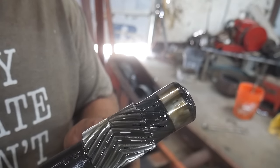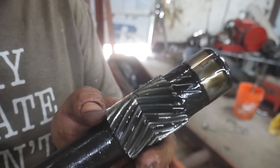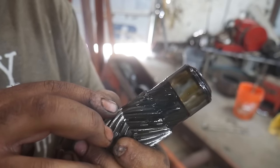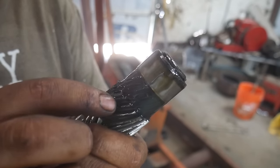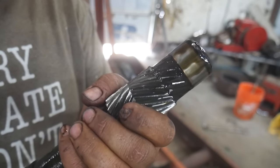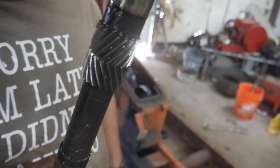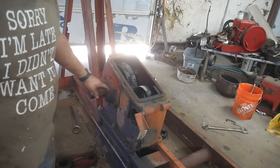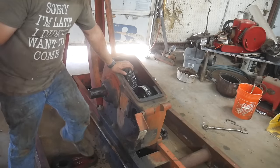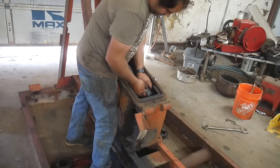Here's the high-speed gear. If you'll notice, the teeth are sharp — they come to a point at the top. If you start looking, there's actually a couple of teeth here where the tooth is chipped. This is absolutely gone. This is right on the ragged edge of tearing up. If this gear tears up, it'll tear up this gear here. I should have checked this before I pulled these bolts out, but these bearings and this intermediate actually feel really good.